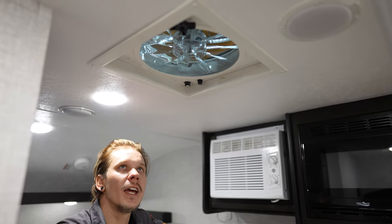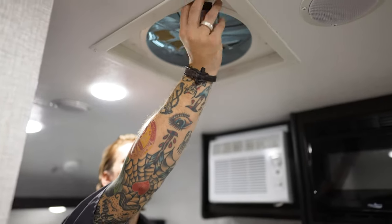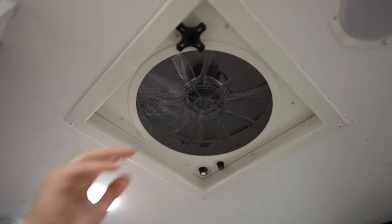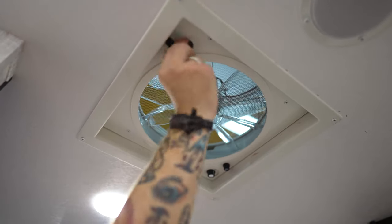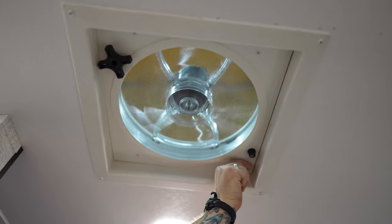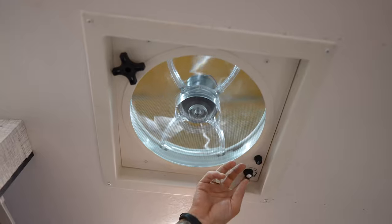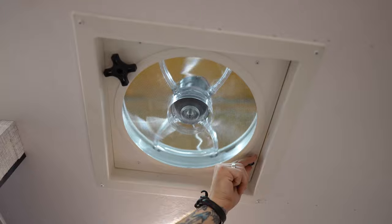Above my head here, we are going to take a look at our high-powered exhaust fan. During transit, this needs to be in the closed position — that's going to be a mistake that you only make once, because it's probably not going to be there when you get to where you're going. To open it, we go ahead and rotate this clockwise to open up that cover. Once we do so, we have some fan speeds here — high, medium, and low. There's also a bus-style fuse holder there, so if this has any problems operating, first thing I would do is check my fuse holder and make sure I didn't blow a fuse.